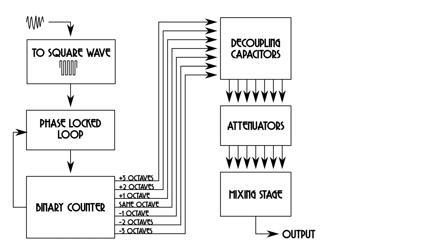So seven signals ranging over seven octaves, and those seven octave signals go into a mixer with seven knobs. You can control the amount of each of these seven octaves in the mix, and then the mixed output becomes the output from the module. So you can put in even just a sine wave — a single frequency — and what you get out is this whole pile of harmonics and sub-harmonics of that input frequency.